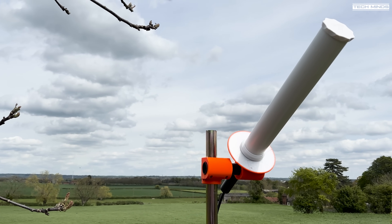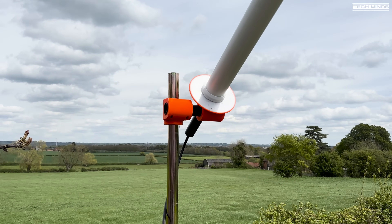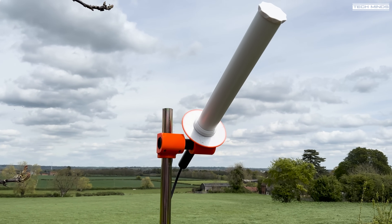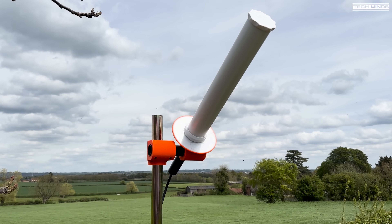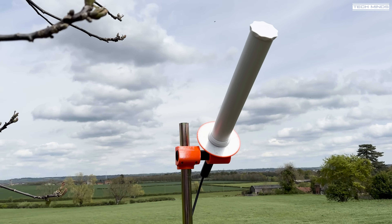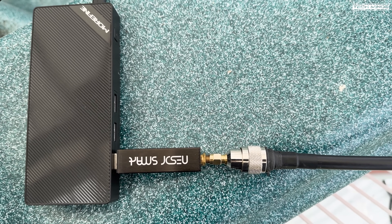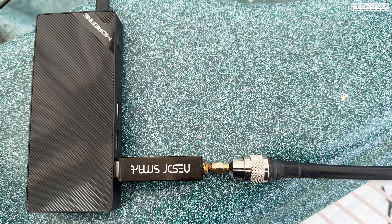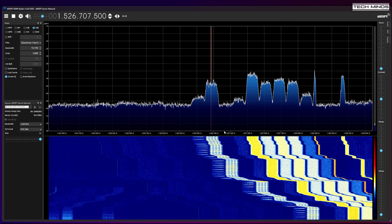You may notice on my install that I have the coax coming out of the rear, and that's because I didn't have a long enough USB cable to mount the SDR inside the housing. So inside the black tube I have the filter and LNA from Nooelec connected to the antenna port, and then I have some LMR-400 equivalent coax running off to my conservatory where I have a mini computer connected to my network running AirSpy's Spy Server. I actually switched the SDR to an AirSpy Mini as I wanted wider bandwidth, but you can use any SDR with a bias-T option that can fit inside the tube if you want to mount it remotely.